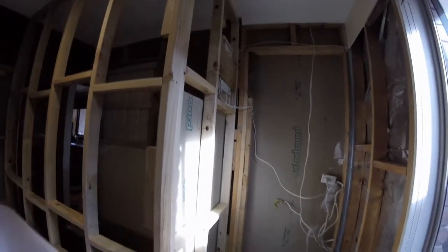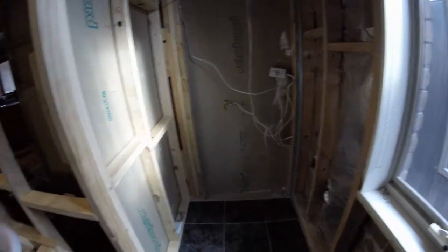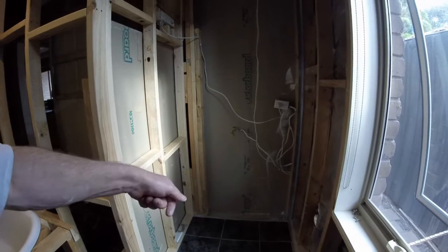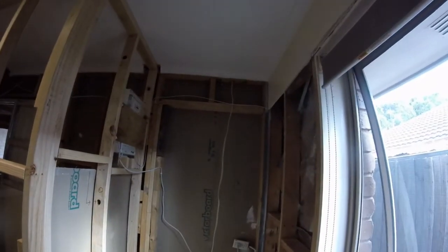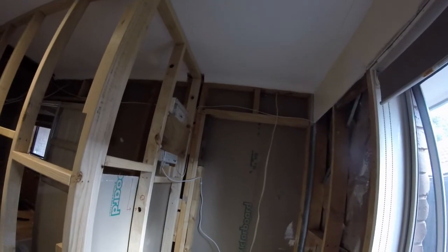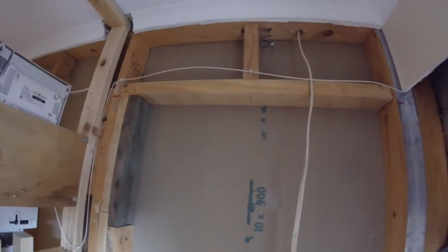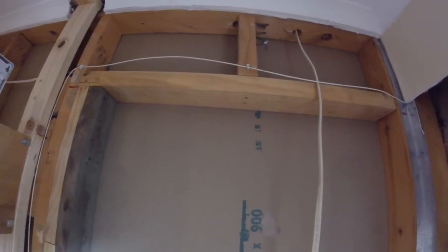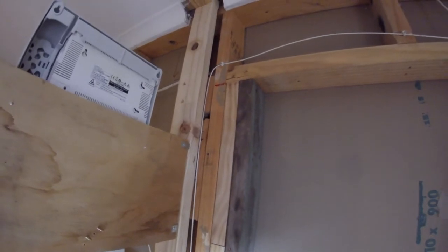The door frame is in - I've used up all the bits and pieces, still works the same. I've packed that out to the right size. Taking that bottom plate out, I cut through that with the reciprocating saw for a nice clean finish. I took the skirting out on the other side, otherwise I would have ended up ripping the bottom of the plasterboard out trying to remove that bottom plate. I put a top plate in at the top there, and a little stud. All the studs are being chiseled out to pass the fiber optic cable through - those little saddles will come out and we'll find a way to fix them in, even if we just put some tape over the cutouts to hold the cable into the grooves.